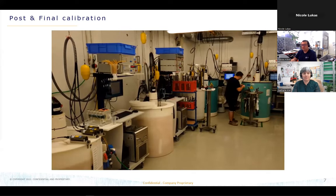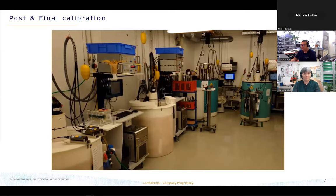The calibration runs around 12 to 14 hours. It depends on the units. For example, IM units take long because we are only able to communicate with one unit at a time. So the calibration is running through the night over 7 temperature points. We have to stabilize the bath for 1 hour for each point, and then we can calibrate the unit for 10 minutes.